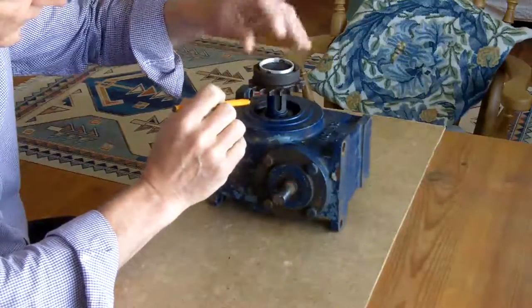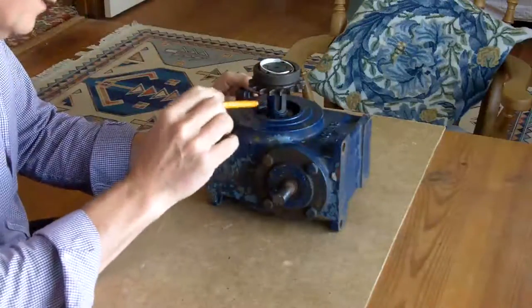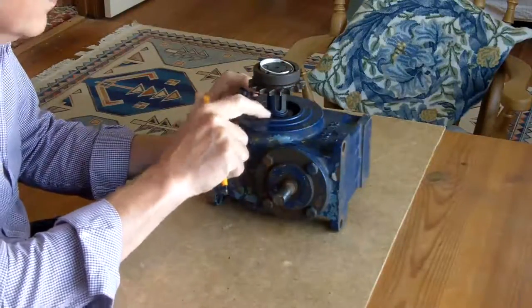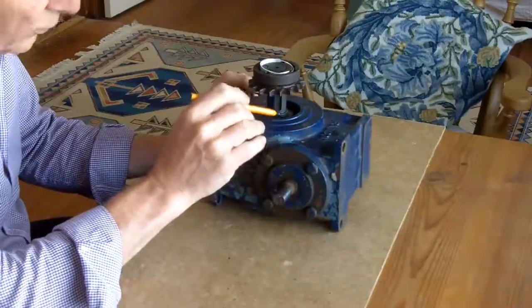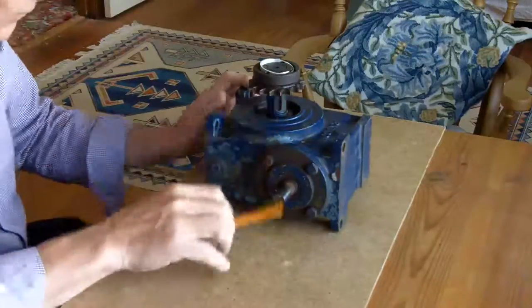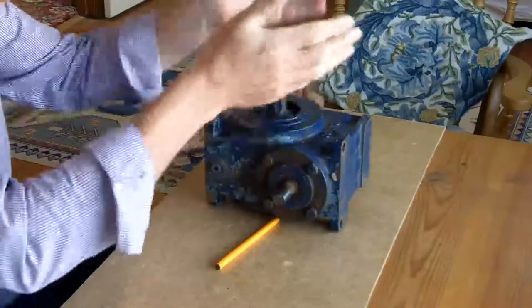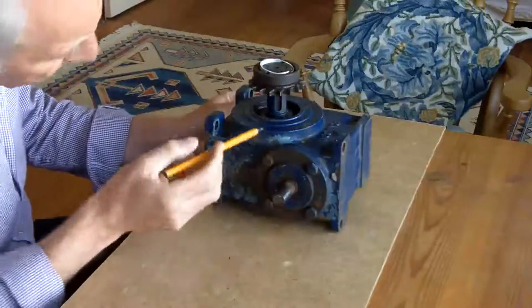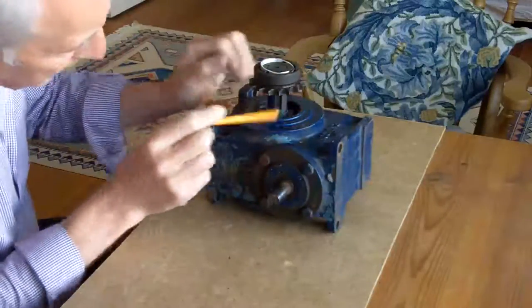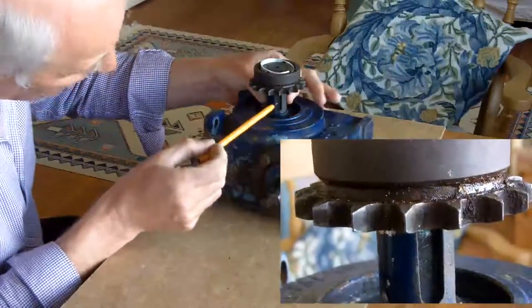This is the mast, so the mast will come down there. This little reservoir here has got every chance of getting full of water. And although it's a sealed bearing, there are ways — if there's water there, it will get into the gearbox and that's no good. So I've got to seal it. I've got the keyway in there, which is actually below the level of this well, so I've got to come up with something that's really watertight.